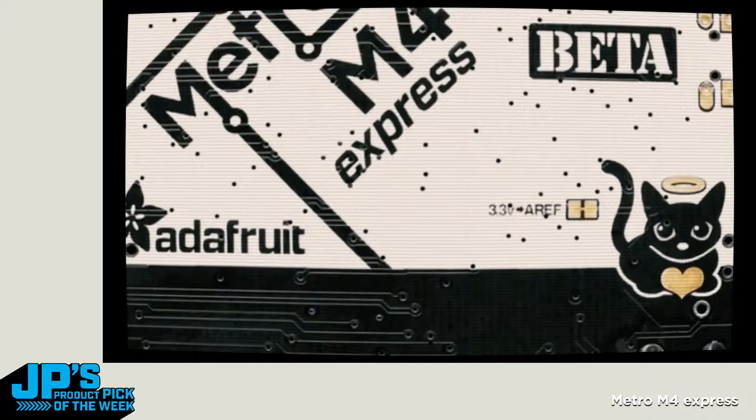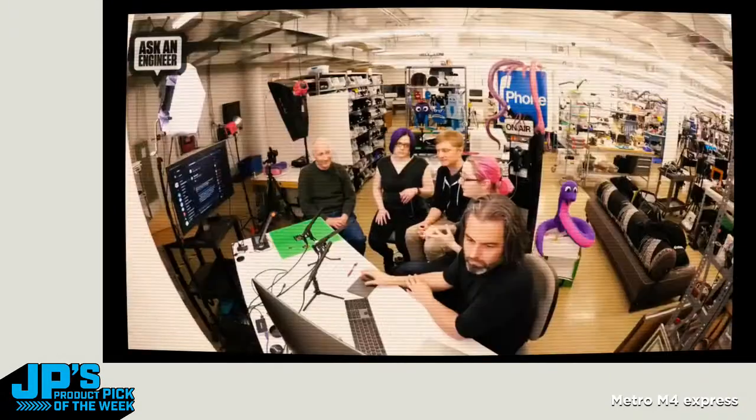It's got I2S, I2C, SPI, UART, CircuitPython. But the big thing about it is it's just incredibly fast. It has a ton of RAM in particular. We're starting with the Metro M4, which is our Arduino-compatible shape. We also have an Arduino core for it that works quite well. For people who want a very fast Arduino chip that can decode MP3s natively — it can do parallel camera capture, it's just hecka fast, tons of flash memory. Maybe you can put an RTOS on there because you've got so much extra room. There's a floating point unit, a proper DSP and floating point.